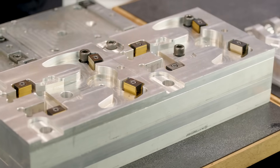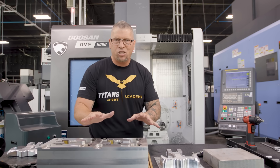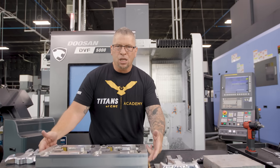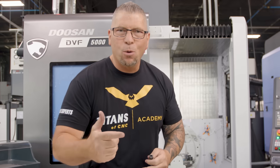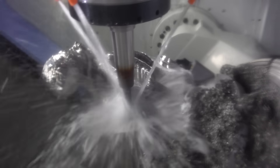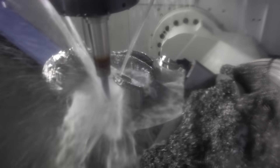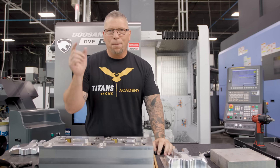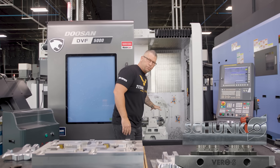Let me explain what I'm talking about. Every time I put the base plate in, I need to take the vices off the table, clean the table, put the base plate on, put all the bolts in the T-nuts and anchors, and lock everything down — and that actually takes time. By the way, you hear that? That's the 500-pound titanium beast octopus being rapped on the machine right over there while I do this video. Pretty cool — okay, back to it.